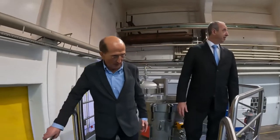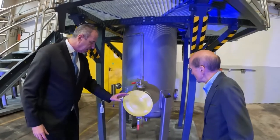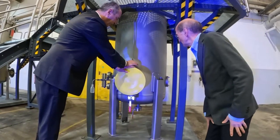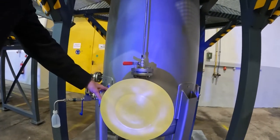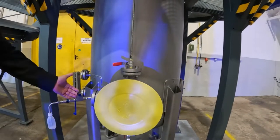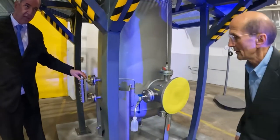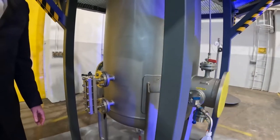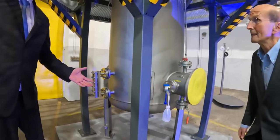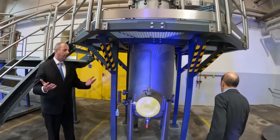Going downstairs, you can see the flange size is significantly different to the other filter vessel. You've still got the drain point and the differential pressure measurement here — again flanged, while on other occasions it was just threaded. On this vessel everything is flanged. This is the outlet. We have here the sampling probe and a different metal gauge which is more robust and gives a little more safety for the user so it doesn't break too easily. This is just a manual drain point — in a lot of places it is still manual because there is a requirement from JIG and others to have manual drain. We want to be open for all different types and all different ways to do it.